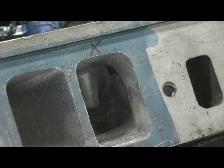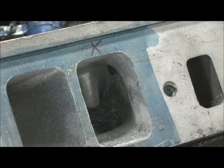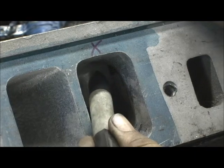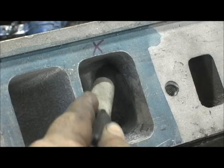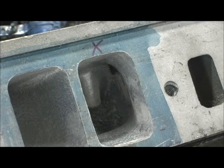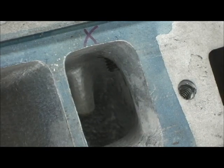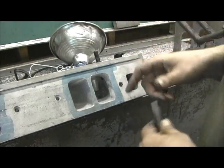What I typically do on this is go in with a marker — I don't have a blue one but I have an orange one somewhere in the shop. I'll take my orange marker and go in there and mark the threads right there. That's going to highlight them. After that you can remove the stud and it's going to show where I painted it orange right there on that thread.